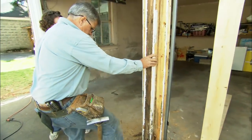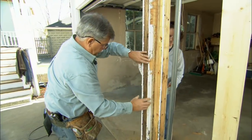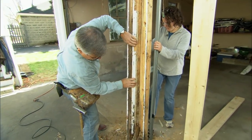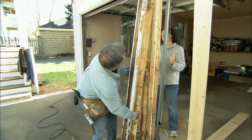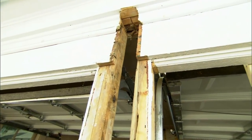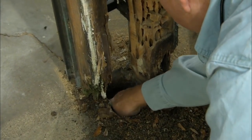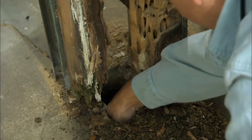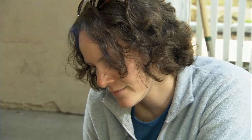All right, let's give it a pull. You go inside and push it with your foot. There we go. Now part of the reason that center post rotted is it was actually in a hole in the ground, just taking in all that water and moisture. Now if you clean this out right down to the footing, while you're doing that I'll mix up some concrete and we can fill the hole back up.